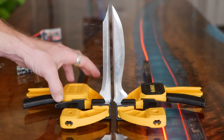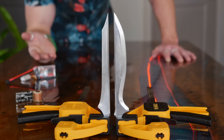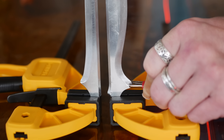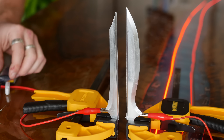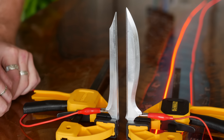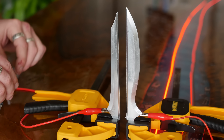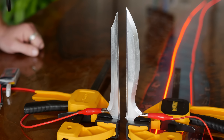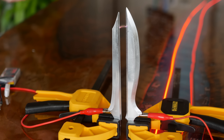This was more than enough current to start the spacing tests for the blades. This test is going to tell me if there's enough current to make a Jacob's Ladder — and if there is, it also means there's going to be enough current for the entire blade to work when there's forced air. Attaching one high voltage lead to each blade, I started with a 10mm gap — too much. Dropped it to 8mm — not quite. Dropping the gap to 6mm, I got ignition. That's what I'm going for.